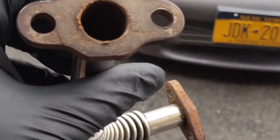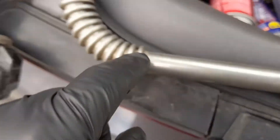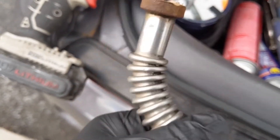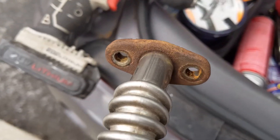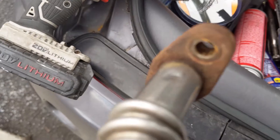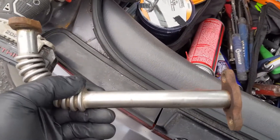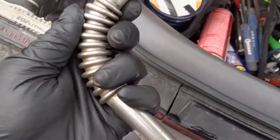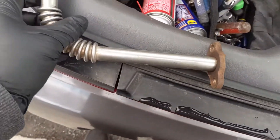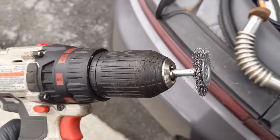The first thing I'm going to do is clean off the rust and get these old gaskets off of both flange ends, make these things look nice again - hopefully get a little shine back. This is in great condition overall. There's a tiny ding on the side of this neck but it fits on there - I know the length is correct and that this end bends a little bit so we can move it around and stretch it just a little. I'm going to use my drill with this wire wheel attachment and clean all this up.